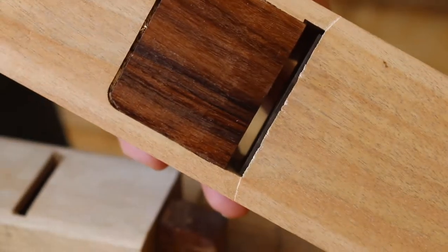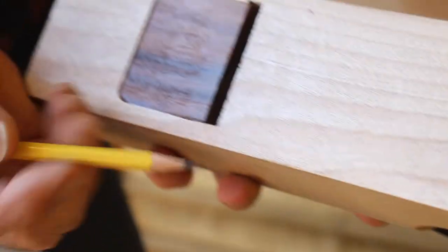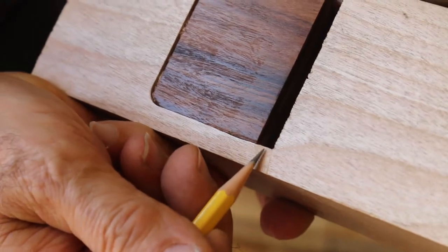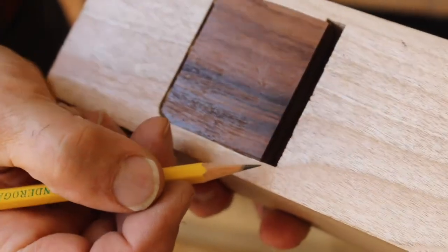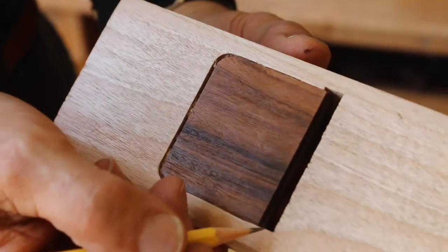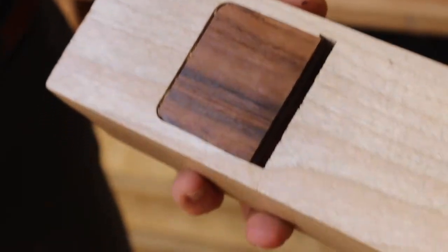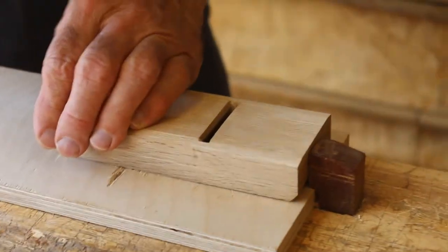I do this cut on all my planes — Western, Japanese. Functionally this is a vertical cut, 90 degrees to the sole, angled off to the side, and then a relief cut that goes back and meets that 90-degree vertical cut. This is very shallow — a 32nd of an inch — doesn't need to be any more than that. But this allows the shavings to find their way out and be eventually discharged. At least it helps them along. Not always foolproof, but I find there's less maintenance when using the tool with these cuts.